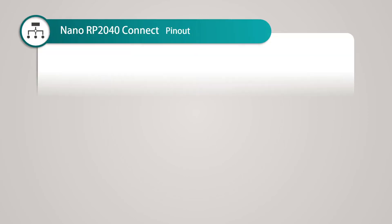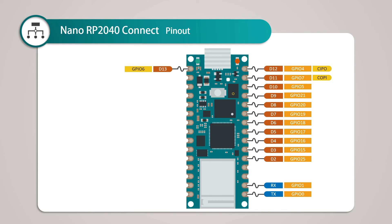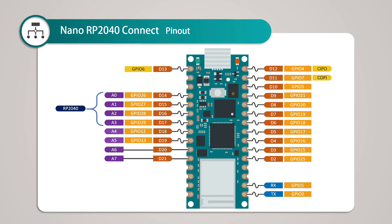Let's take a look at the pinout of this development board. There are a total of 14 digital pins, from D0 to D13, where D0 and D1 are used for serial communication. There are eight analog inputs from A0 to A7, where A0 to A3 are connected to the RP2040 and A4 to A7 are connected to the Nina W102 module. Each analog pin is connected to a built-in 12-bit ADC. The I2C connections on pins A4 and A5 are used for onboard peripherals and are pulled up with a 4.7kΩ resistor. All analog pins can also be used as digital I/O pins. Almost all digital and analog pins except A6 and A7 can generate a PWM signal. These pins are 5V intolerant, so be careful when hooking up sensors and actuators. The reset button is connected to the active-low reset pin of the RP2040 via a pull-up resistor.